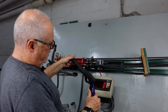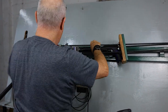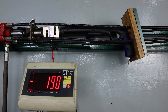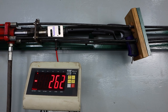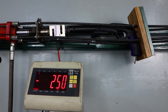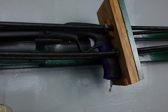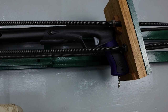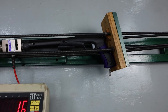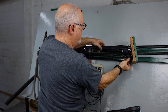That's been our standard handle for a long time. Now this is the one with cosmetic defects — said to be exactly the same material, let's find out. At 100, 120... I'm seeing a little bit of distortion there. We went right up to 270. There is a bit of flex in the handle itself — zoom in while I slack it off. You can see how much actual flex occurs before it comes off strain. Good that it didn't break — more than adequate — but cosmetically we're not happy, so we've gone to a new material.